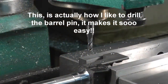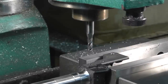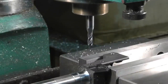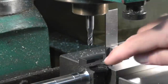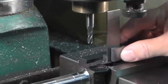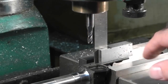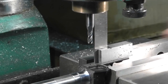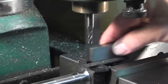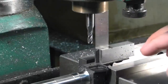I want to show you guys a better method of drilling your barrel pin hole if you have the equipment. If you have a milling machine, this is how I do it - the easiest and probably most accurate way, and I never have to step up the barrel pin hole when I do it this way. Using my square, I run it up against my end mill with it sitting on the trunnion. If everything was manufactured properly, your barrel is going to be perfectly 90 degrees to the plane of your trunnion. Make sure it's perfectly square when you tighten it down in a vise.